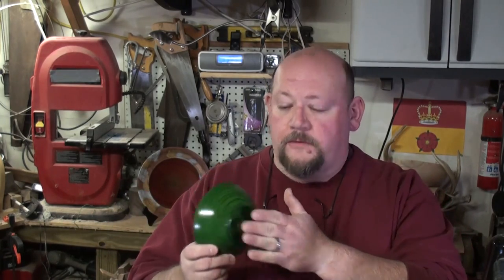Remember that when you do the wax, you do want to use a sealing coat of some sort, either a brush-on application like I showed you, a clear gloss nail polish would be fine, or use, as on this one, spray lacquer. It just blends in with the entire rest of the piece, and now I'm certain that the bottom is protected, it is glossy, it is all the same, and that gold detail is going to be protected from people picking it up, putting it down, moving it around. It'll be just fine.